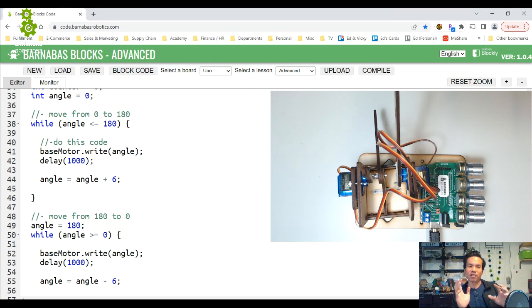And then when you stop, it jitters a little bit. And then the motor's like, oh, let me fix it. And then it overcorrects, and then it jitters the other way, right? And now it goes the other way. And that's why you're getting this, and only with this heavier object.